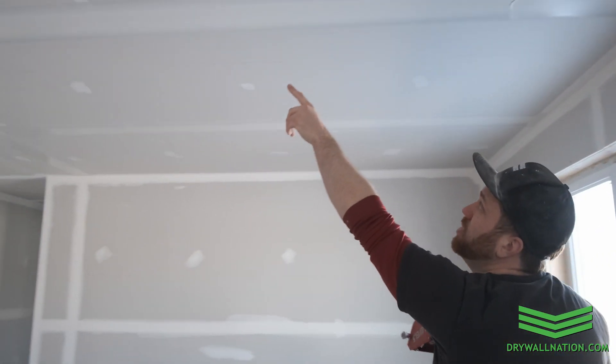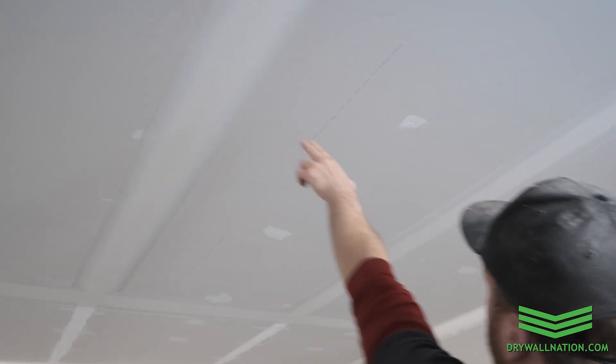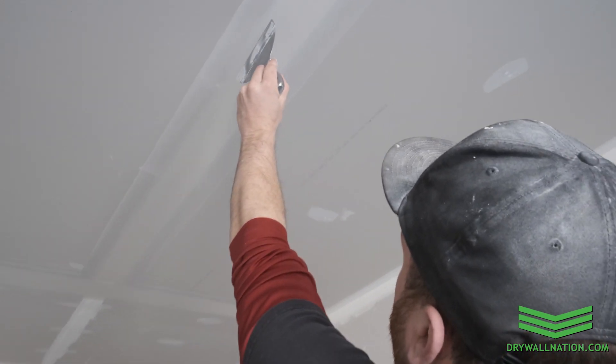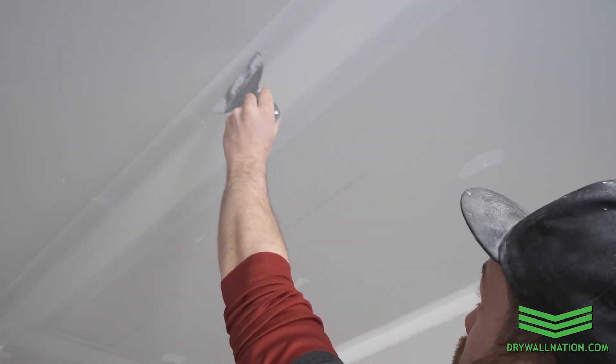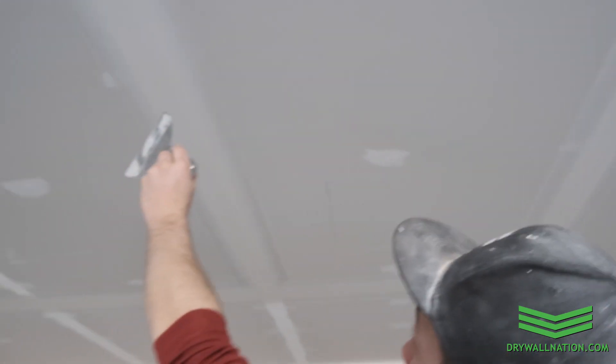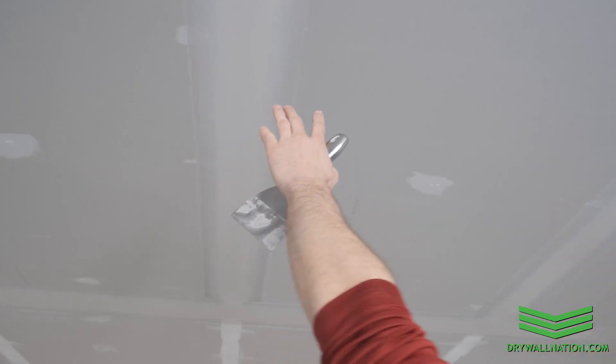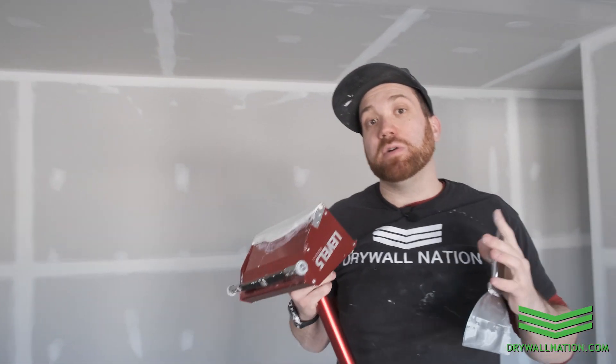You can see the difference between these two joints. This one is a little more loaded than the other. On the edges of the lighter one you can already see it's a little dry — you can see the shoulder of the drywall. On the other side you can't see it as much, and that's the fill I'm looking for. I want a thicker coat on the first pass so that when I come to run my 12-inch I'm doing a much tighter skim.